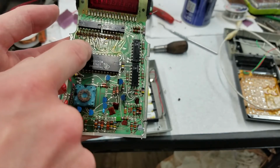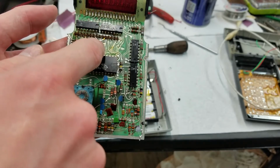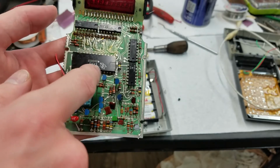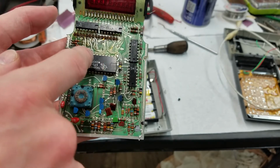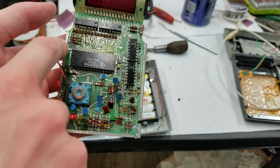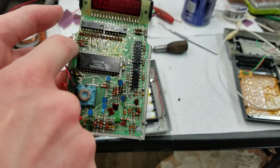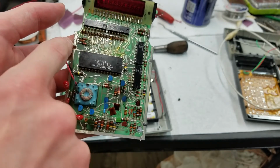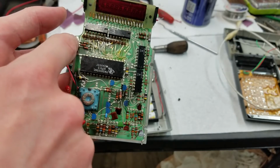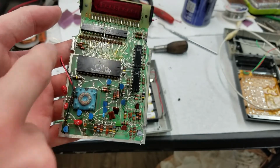So if you remember, one of these outputs listens for a digit drive to be connected to it to register a key press for a digit key, and the other one listens for one of the digit lines to be connected to it to detect a control key. And then those 2 lines go through these diodes. In addition to this third diode is for the D key. So this line will get a pulse on it through these diodes anytime a digit key, a control key, or the D key is pressed.